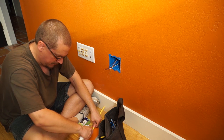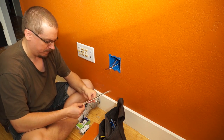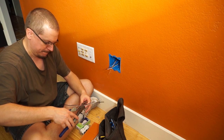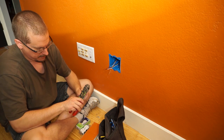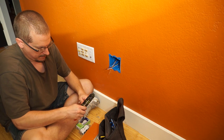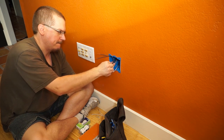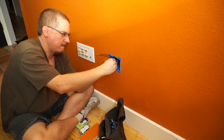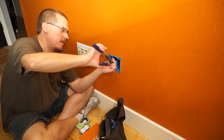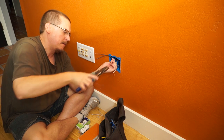Very technically speaking, I could have connected my outlet serially with the wires since each outlet has two sets of posts and I could chain them together. Installing them in parallel is quite a bit more work, but I always think it's worth doing, so I do it whenever possible. What this essentially entails is separating the hot, neutral, and ground, and then for each of them connecting up the incoming wire, the extension wire, and two pigtails into one bundle. The part that takes me the most time is connecting up the pigtails to the other two wires — the pros can probably do this in their sleep, but for me it's always a bit of a struggle to get them all twisted up together.